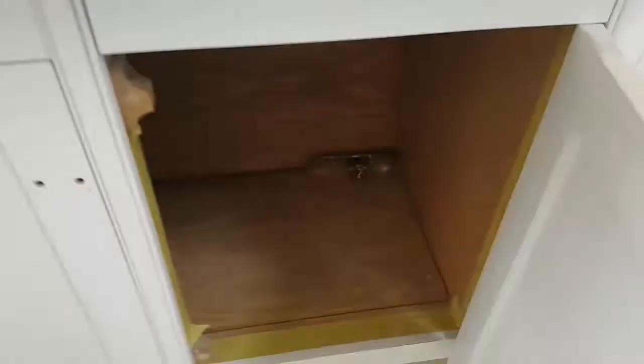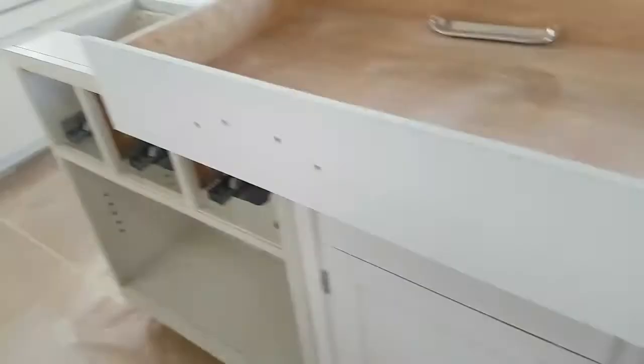I've masked up inside the units to make it easier for me to cut in. The interior is finished, so the idea is I'm able to paint this - I've got to get three coats - so rather than try and cut it all in on each coat, if I mask it up I'm able to move quicker. Every unit that has a door in it has been masked up, so that took a bit of time as well.